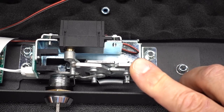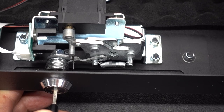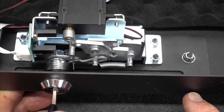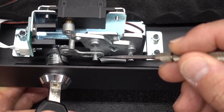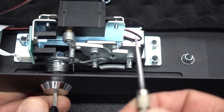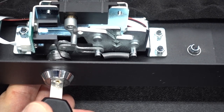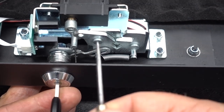The locking mechanism is a lot simpler than I thought originally. In the locked position, there are two ways to get this open. The first is with the key. Remember, when the cover is on there's one-eighth inch steel on the outside and one-eighth inch steel of the inner protective covering, so you have to drill through one quarter inch of steel — still possible. When we turn the key, notice it takes up the slack on this little peg. It's held together with a mechanical block — the little teeth are engaged solidly with each other. So even if you somehow reached in there and tried to manipulate it, there's just no way to shim it; you're not going to overcome that block.